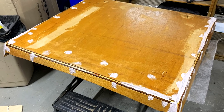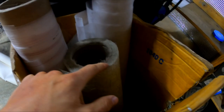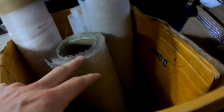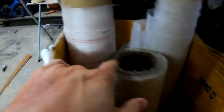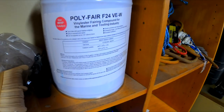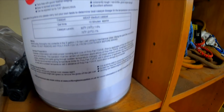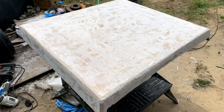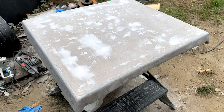Now that the hatch is finished and shaped properly I could fair and fill all the imperfections and screw holes and get on with the fiberglassing. On the hatch I'm going to do probably four or five layers, maybe a little less, because the plywood provides most of the strength - then skinning both sides with three layers of chop strand, a layer of tissue, and then peel ply so we can fair and sand it and get paint on there. I'm also using a fairing compound called Polyfare, which is polyester-based, so it'll work chemically with our polyester resin. Gel time is about 10 minutes.